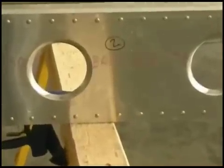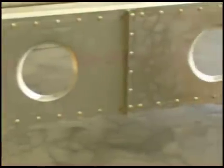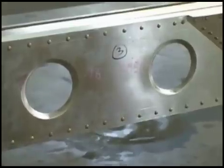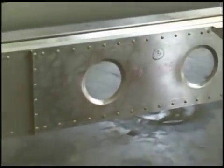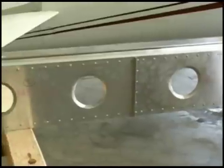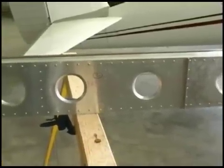There's where our second rib goes, our third rib, and all the way through rib number six. So by labeling these rib numbers on the spar, we can also label the ribs as we install them so that when we remove them to deburr, we won't lose track of which rib goes where.